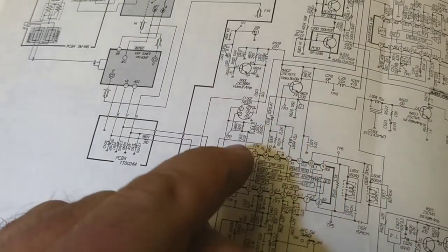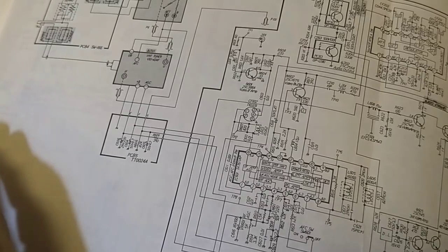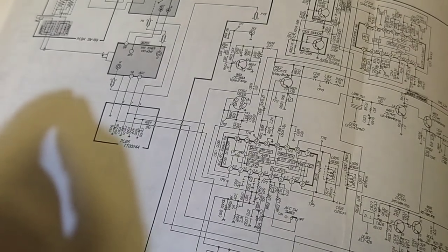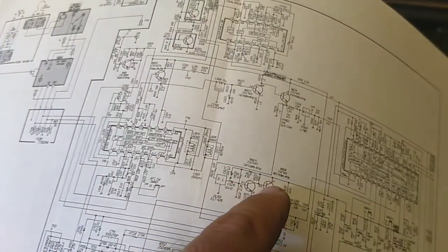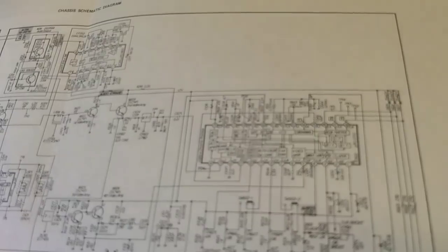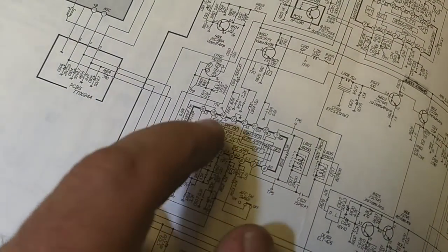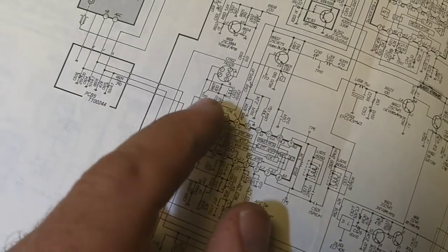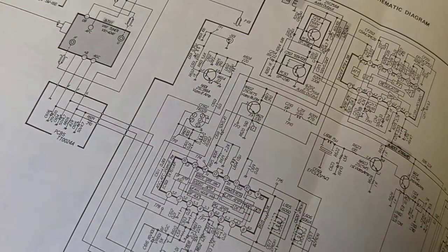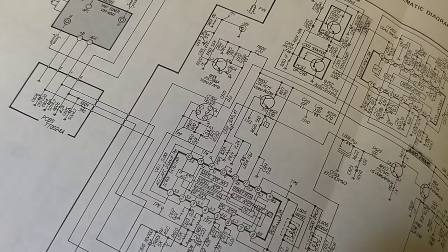L603 is supposed to be a tuned circuit that feeds into your IF input for the IF AGC video amp. So if we're getting incorrect bandpass here, we could be losing our color sync information. That's interesting. It goes through our video amplifier stages and then to the video input on the IC here. All the voltages on that are maybe half a volt high, but they check out. The fact that we don't have any core in L603 — I think that's significant.